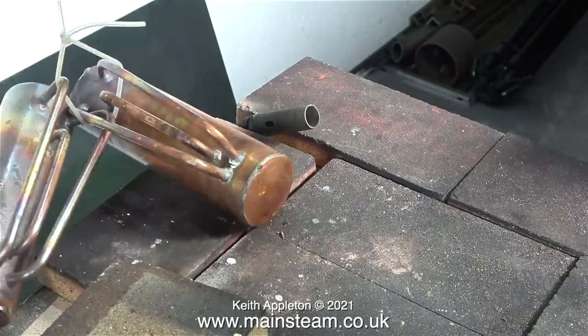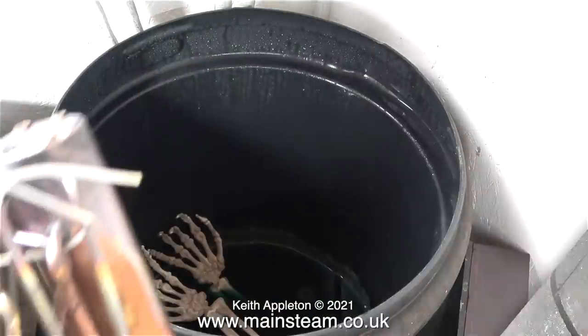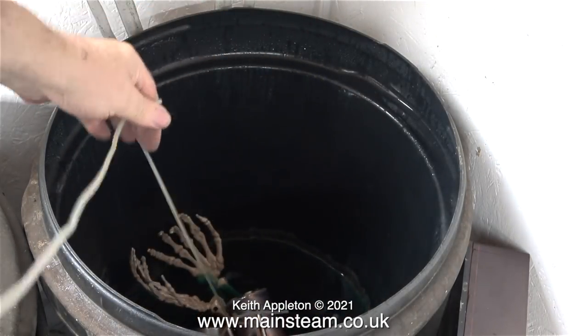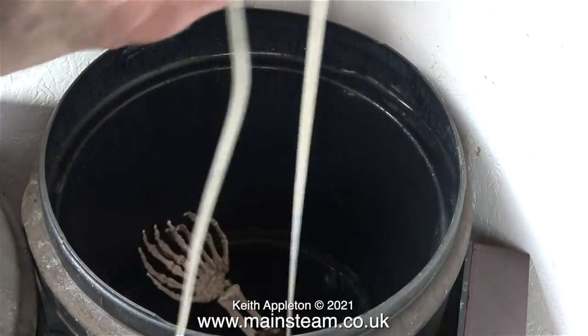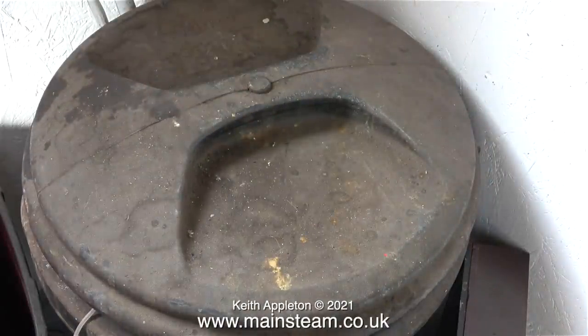It's very important to make sure that the boilers are cool before dropping them into the acid bath. So I've tied them together — here's the acid bath — and in they go. These 500 boilers are very small and very light; they sank to the bottom when they filled up with acid. I'm going to leave the boilers in the acid bath for about 24 hours.